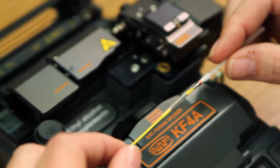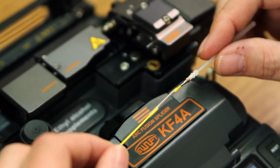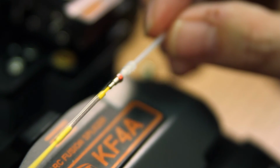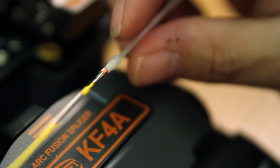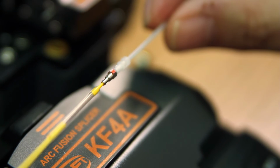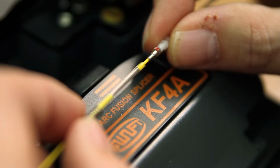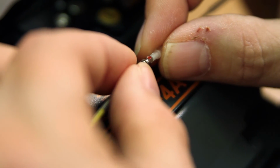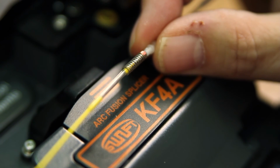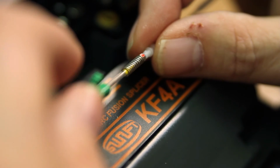Final assembly of the LC APC is critical to proper performance of the connector. On one of the sides of the hexagon nut, there is a red dot. This red dot indicates up. Bring your spring up, all the way to the back of the hexagon nut. Bring your back boot and back shell up.